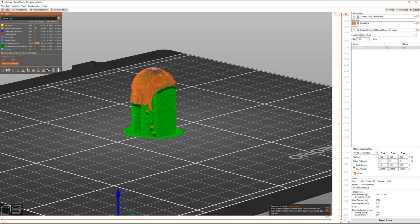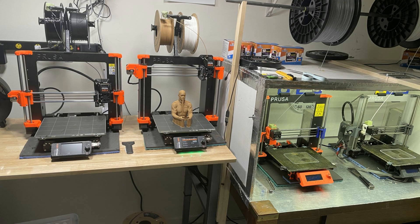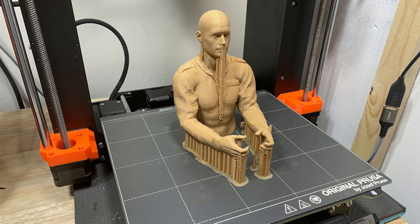Then I go to one of my four Prusa printers. I'm using my Mk4s right now for all my PLA stuff; my other two are for ASA, ABS, nylon — anything where I need a heated enclosure. I decided to do this in PLA, but as a warning: if you're going to put this in a cockpit under the canopy and it gets really hot, PLA will get soft and may deform. There are higher-temperature PLAs on Amazon, so just make sure it doesn't get too hot in the sun.